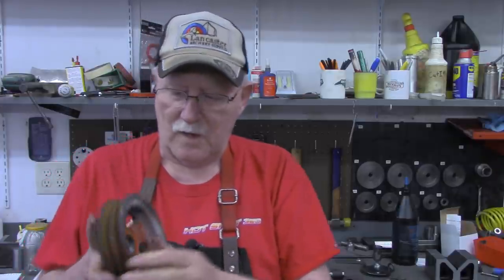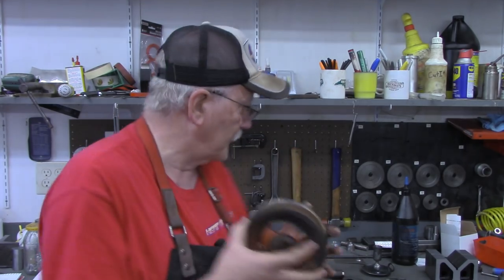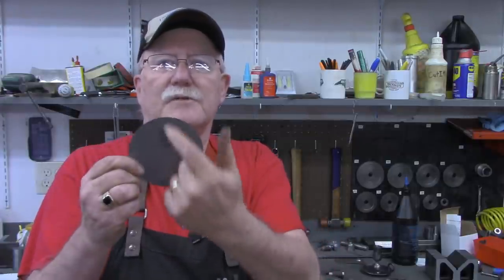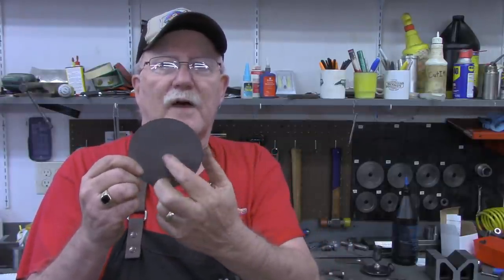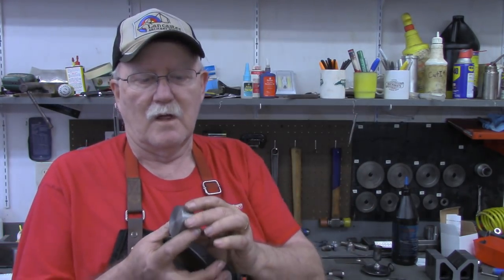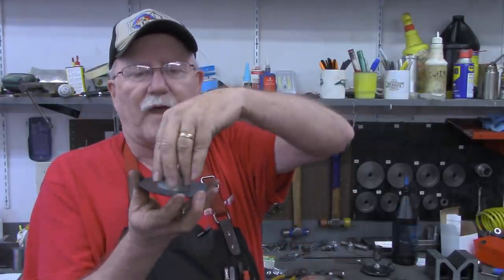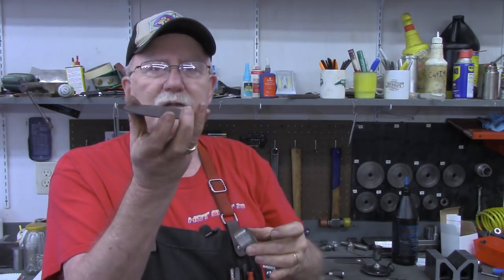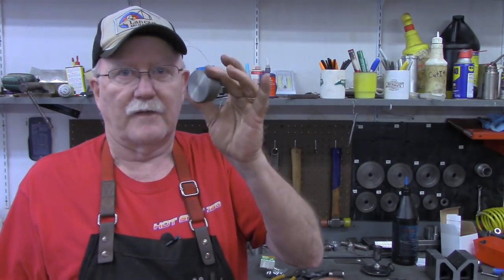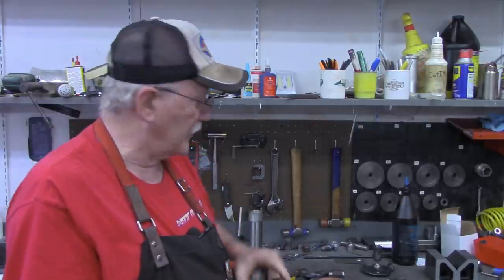The reason I want to do a plug for it - once I get it plugged I'm going to put a five millimeter hole through the center of it. I will do the same thing with these sheet metal pieces - put a five millimeter hole in each. And then in the piece we use to press down on, we'll have a five millimeter screw or bolt sticking through it. That will align everything in the center of this and align this in the center of our sheet metal, so we'll push it in the center all the time.